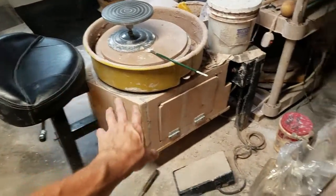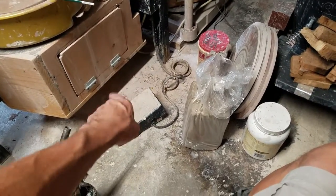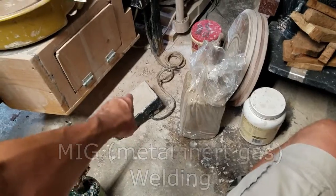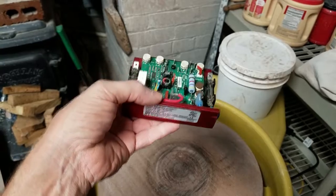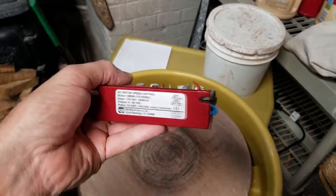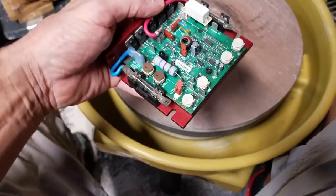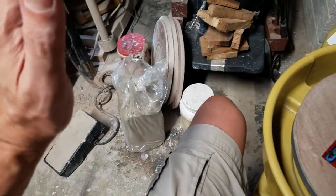Since I built the Raven here and used a potentiometer with a rack and pinion — the old knob-style potentiometer with a rack and pinion style pedal, basically an old MIG pedal — I bought that seven or eight years ago when they were like $40, now they're like $140. Inside the control box I use a KB DC motor speed controller that you can adjust the horsepower of the motor with the big resistor. They're made in Florida and it's one of the best speed controllers you can have. You connect a knob-style potentiometer right there, and I like the rack and pinion style pedals because the degree of control you have over them is fantastic.